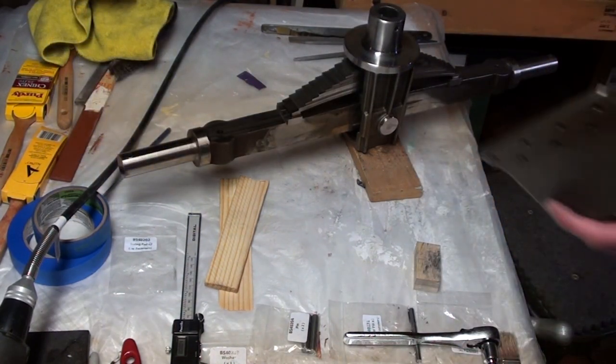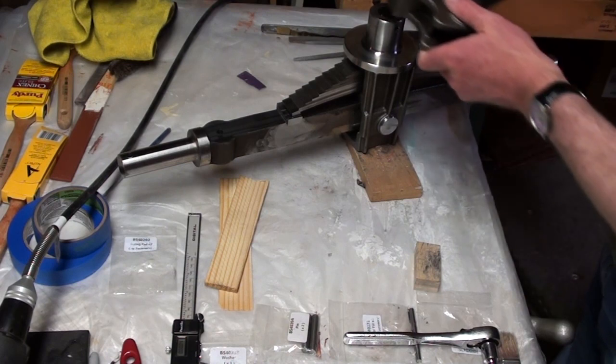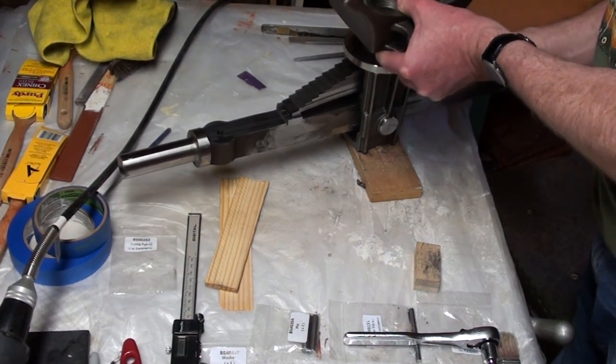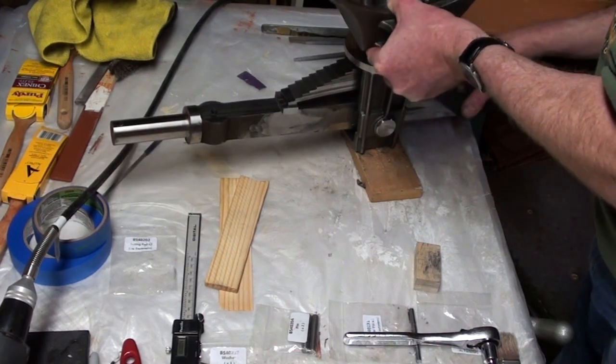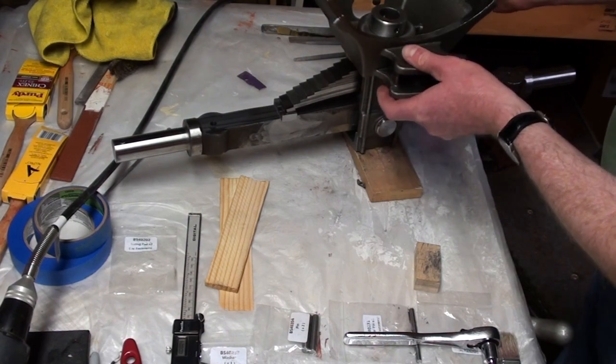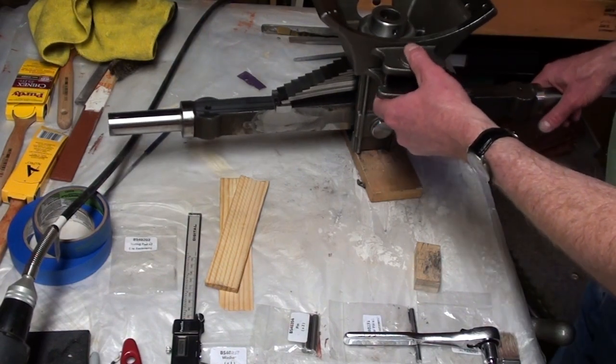The smoke box saddle drops on top of the pivot casting. A flanged retaining collar is placed over the protruding top of the pivot casting. A pin passes through both parts to secure the smoke box saddle casting in place. To secure the pin, two split pins are used.